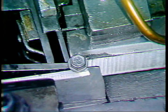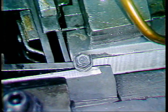Before adjusting die match, you must check the die match, as this will determine the direction of adjustment required. To check the die match, engage the starter finger and place a blank in the bottom of the feed rails. Jog the machine until the starter finger is completely retracted, then jog the ram forward until the blank has turned about one half of a revolution.